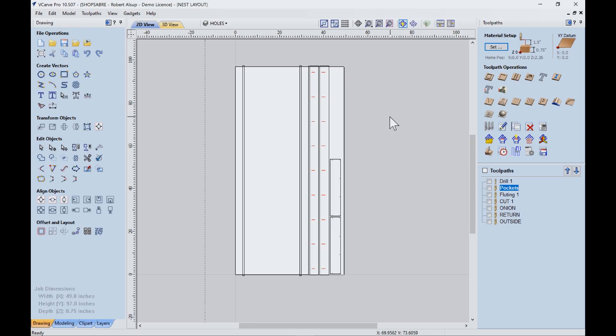This is a part I call the box. It basically holds the resin, and the slab fits inside of it. It's a really critical part because if you have a leak, the resin runs out. Here's how we approach that.